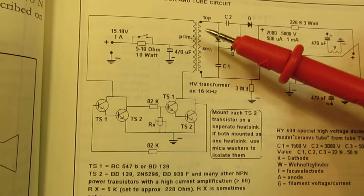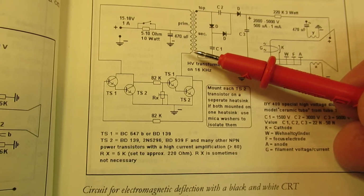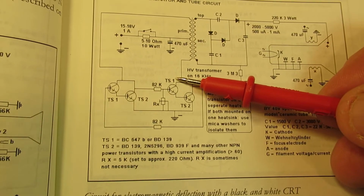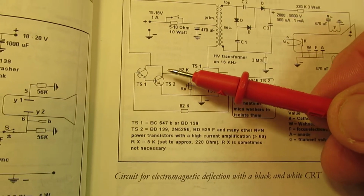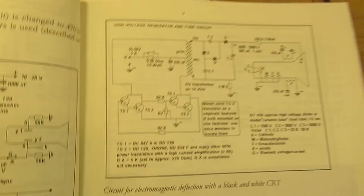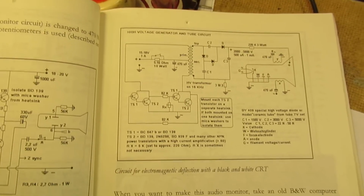That's shown here. So this is the tap. The coil is on one side connected to the double Darlington here with the collectors connected, and the other side of the coil is connected to another double Darlington with the collectors connected. And when you couple the signal back, it will start to oscillate. Anyway, a properly working circuit.